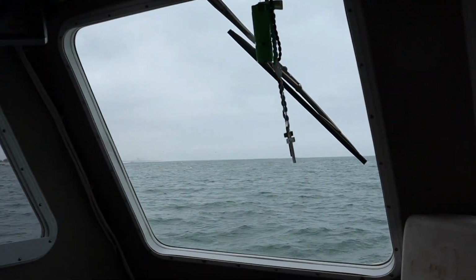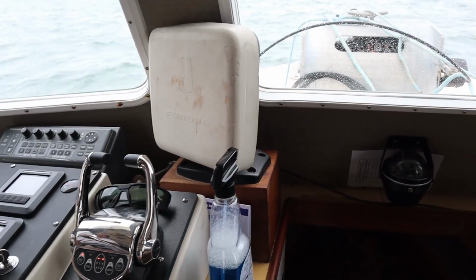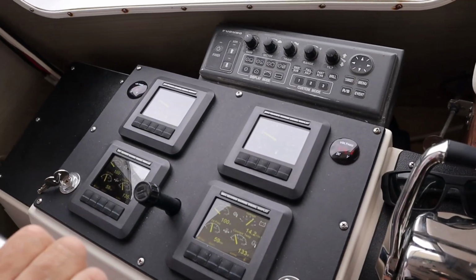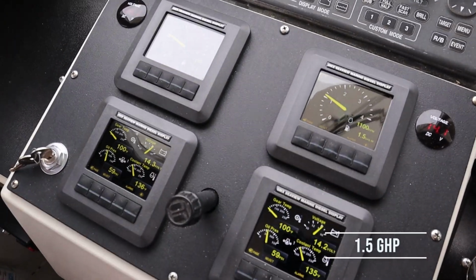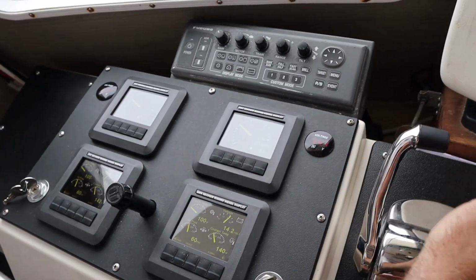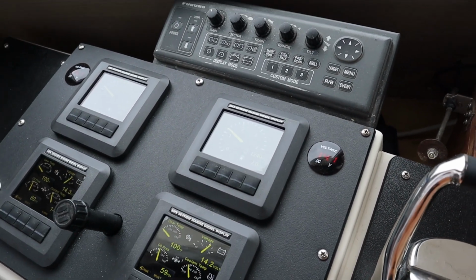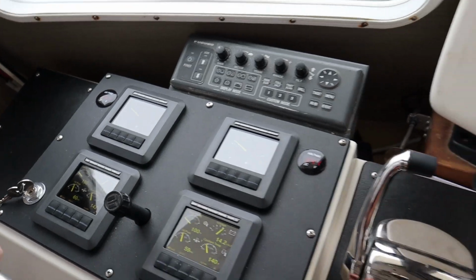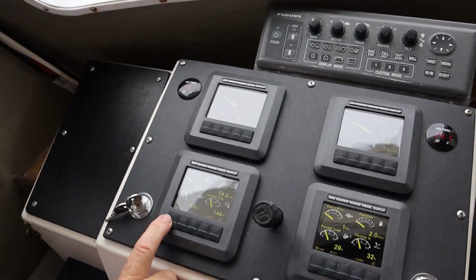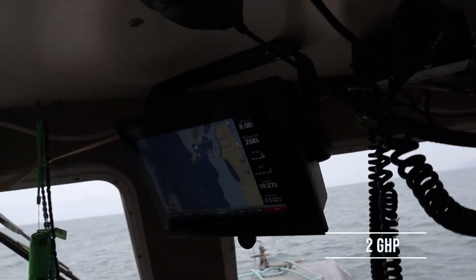So we want to take it right through a series of RPMs, just kind of pin it there. We can go 100 RPM at a time or so. That's 1100, and that's 8 knots. Just getting close, 1220, 1230. Yeah, settle in about 8.5 knots.